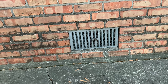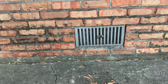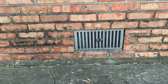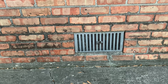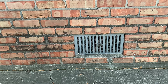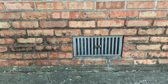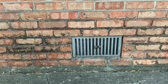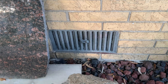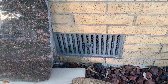I've just discovered another small issue. There are three vents located on the outside of my house that are supposed to allow the crawlspace to breathe. Some knucklehead decided to cover them with insulation and what looks like a piece of wood from the inside — that could also be a huge reason why there's so much moisture and humidity in my crawlspace. They're now open and free, so hopefully all that humidity and moisture can escape. Here's the second one that was blocked and is now open so the crawlspace can breathe properly.